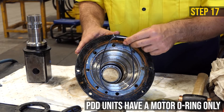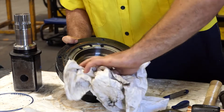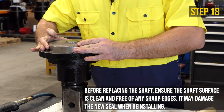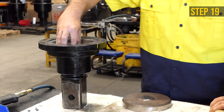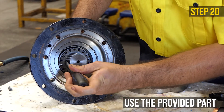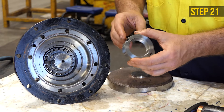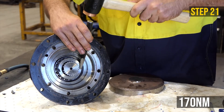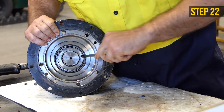Remove the old O-rings from the gearbox and motor, scrub them with a steel brush and wipe clean. Inspect the parts. Place the housing on the shaft and using a metal plate and hammer, tap the housing until the shaft is fully inserted. Reinsert the upper bearing. Place the locking tab washer over the shaft lining up the internal tabs. Screw the nut into place with the flat side up to approximately 125 foot pounds. With a chisel and hammer, turn the nut recess so it lines up with the locking tabs. Lock the nut by bending the tabs into the nut's recess.